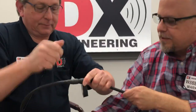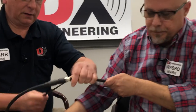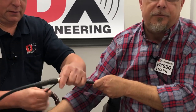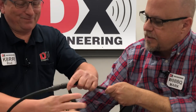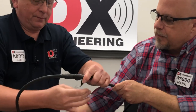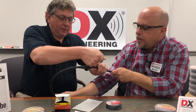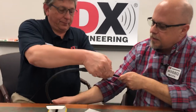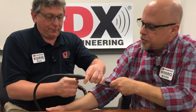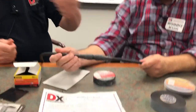Personally — everybody has a different way of doing things — I actually like to put a run of electrical tape on first. Sometimes it aids in ease when you go to disassemble, with no sticky stuff left on the connectors. Basically what you're doing here is putting the moisture protectant on first. And there it is — done. That's a completely sealed joint. Look how nice. But it's not UV protected.